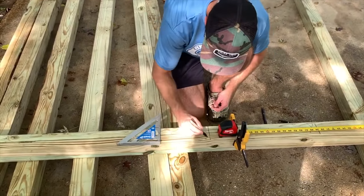After installing the first 4-foot by 8-foot segment of slat wall, I moved on to another wall and I did the starter trim at the bottom, the vertical J trims on the side, and then slid all the panels into place, securing them with the self-tapping screws into each stud.